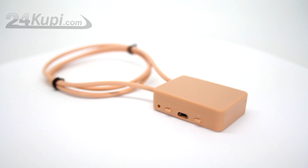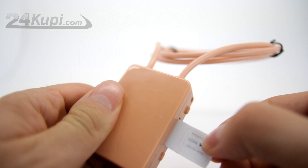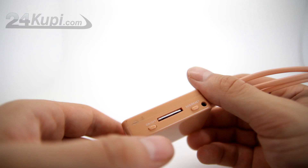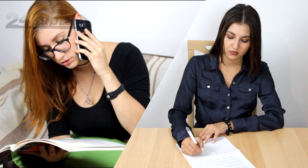To work with the GSM Loop it is very easy. Insert the SIM card like this. Make sure there is no pin on the SIM card. Turn it on by pressing the On button for 3 seconds. It will automatically pick up incoming calls, so you don't need to worry about losing your connection.